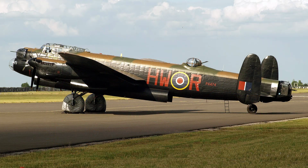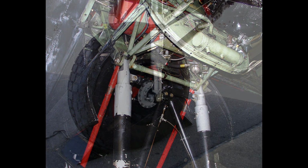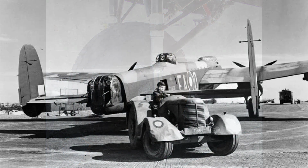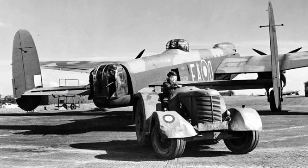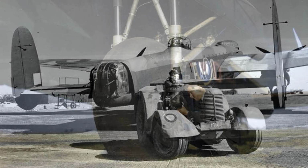When the main wheel units are down and the aeroplane is resting on the wheels, the jury struts must be fitted between the top joint of the shock absorber strut and the joint at the centre of the retracting strut. These will enable the aeroplane to be towed or other maintenance work to be done without any danger of the main wheel units being retracted inadvertently.